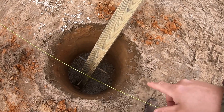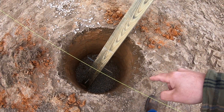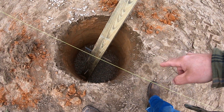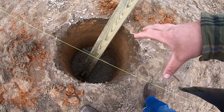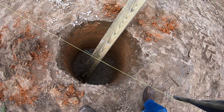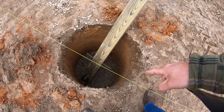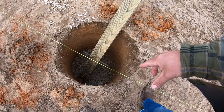The plans call for, and it's very common, number 57 rock — this is called a free drainage type of rock that you put in the bottom. My plans called for six inches of it. That's very common whenever you put posts in the ground. That way, if water gets in there, it'll allow it to free drain on down and not rot out the bottom of the post. So that's pretty critical — do some sort of drainage in the bottom.